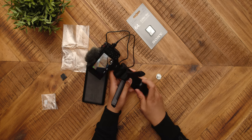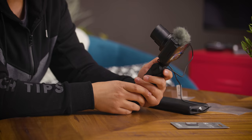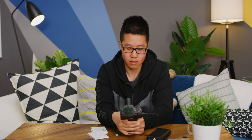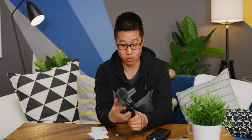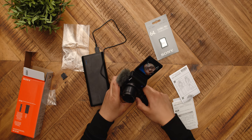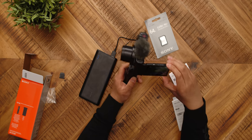Let's pop in the battery and see how easy this is to set up. In theory my remote is now powered — it's blinking red. For pairing, you hold the photo button and zoom rocker up to enter pairing mode. It says 'allow connection for device' and then 'connected.' That was pretty seamless. Now let's put an SD card in and see if it works. After pairing, you also have to go into settings and toggle Bluetooth remote control to on — and now the remote should work.